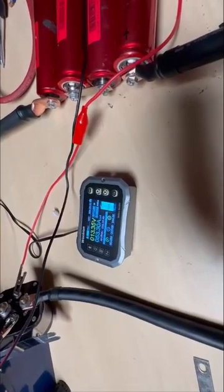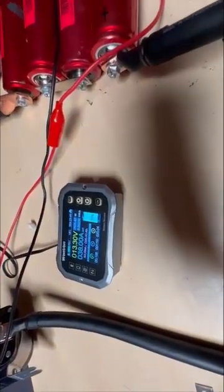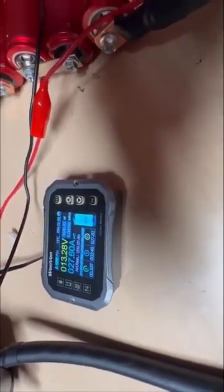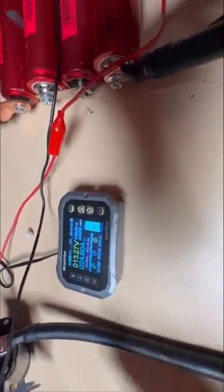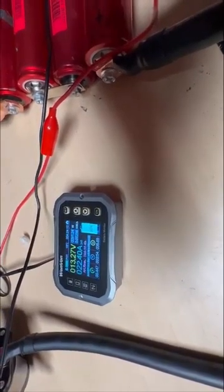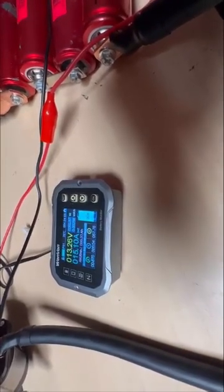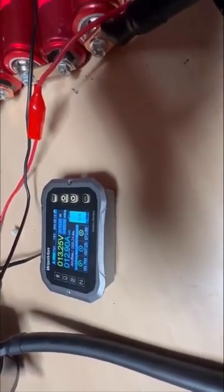We started off at 95 amps — there was a 95-amp burst — but we're already down to 50. You can see we had it set to 100 even though it's only a 90-amp-hour bank, and we can watch how much current has actually gone through. It's already dropped down to 23 amps, so we had a little bit of a surge there. It wasn't really too bad.